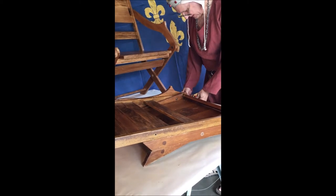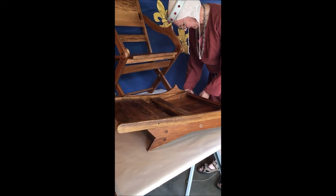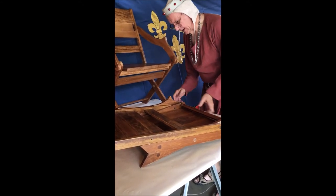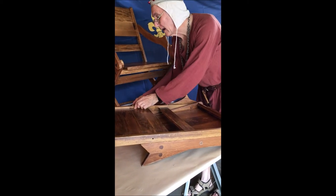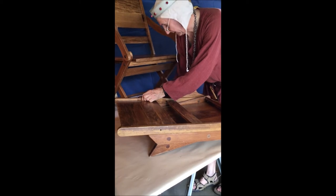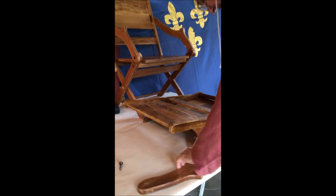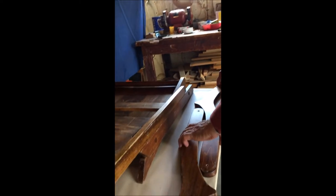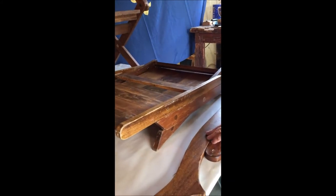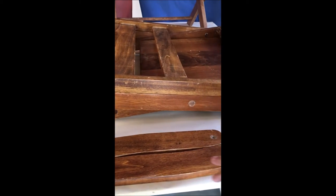The 4mm has an English equivalent — I don't know what that is right now, it could be something like 5/64ths — but it's in the handout. So it doesn't matter that I have it memorized. Let's reiterate these arms: you can lay them out and get two out of one piece of lumber. That will be about 50 inches of a nominal one-by-six, which is more accurately three-quarter inch by five-and-a-half.